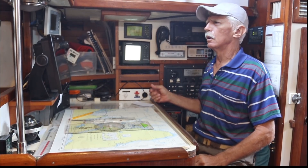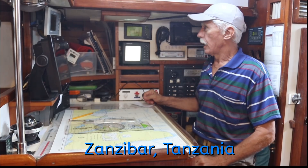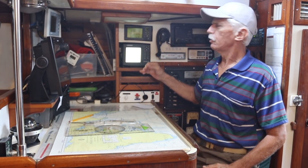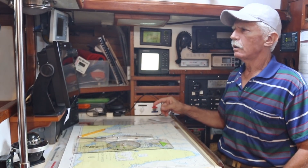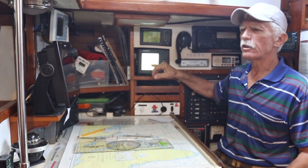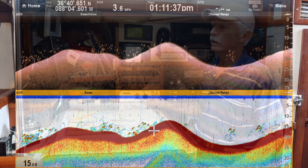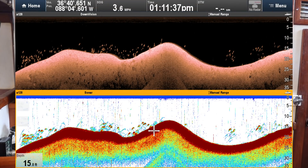Water temperature here in the marina is 86.8 degrees Fahrenheit — some of the warmest water we've seen anywhere. It also gives speed through the water. The Raymarine depth sounders give us similar color information at the bottom indicating hardness — whether it's mud or rocks. The Raymarine uses a sweep of frequencies rather than a single 50 or 200 kHz, so some frequencies give finer detail in shallower water and others go deeper, resulting in much better definition of the bottom. You can actually see fish down there.